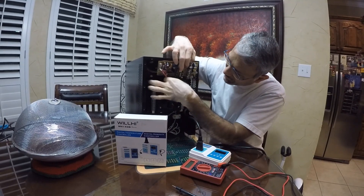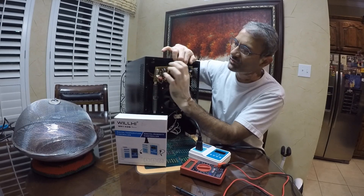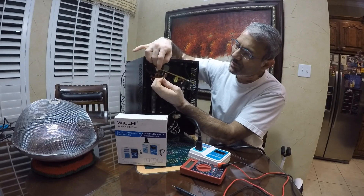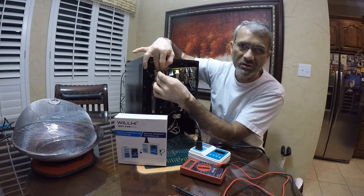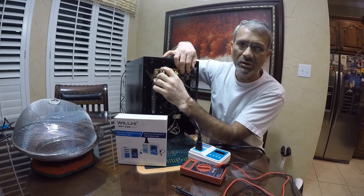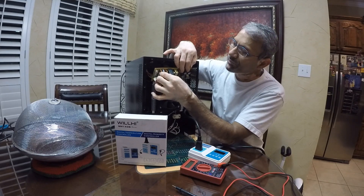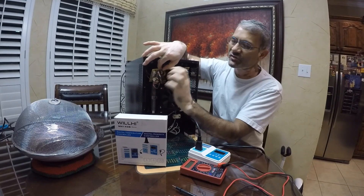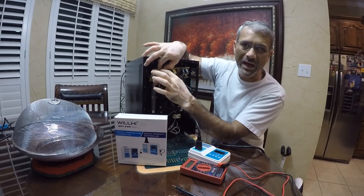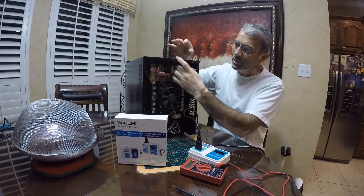So that's our goal. You're going to have to find the two wires — in this case this red and black wire — that go into this cooling block. All you have to do is disconnect those two wires. In my case they're like a pin connector so I can just simply pull them out. If you have a board where they're hardwired or soldered, you might have to cut them off. Make sure to check the voltages while it's running — anywhere from 3 to 12 volts. Then just remove them and switch their direction: the black goes where the red was, and the red goes where the black was.